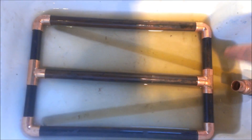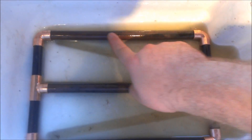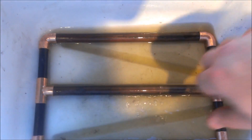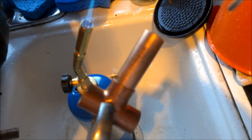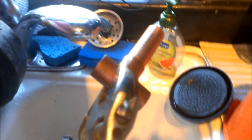I ended up cutting four three-inch pieces to connect the fittings. This fluid in the container is vinegar — the elbows are still fresh from the bag, but the pipe has oxidized so I'm going to clean it with steel wool and vinegar, then run a steel brush down the middle. I'll remove a section and solder in an extra inch or two of pipe to connect to the spigot, heating at the tip of the light blue cone and touching the solder to it.